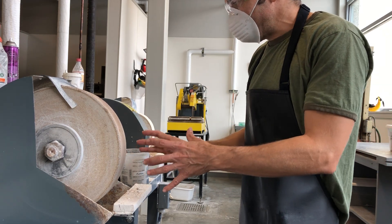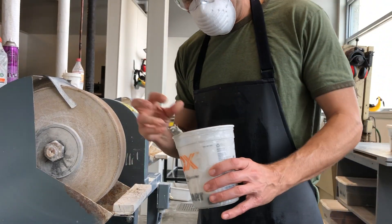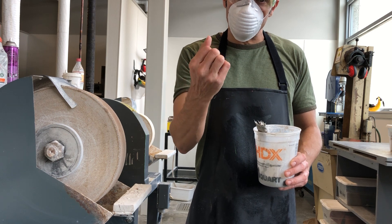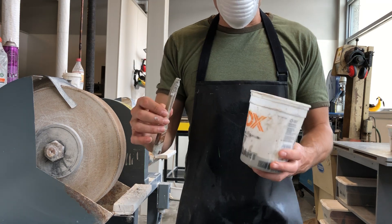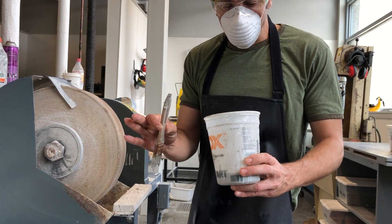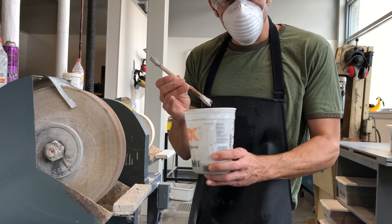This particular wheel here — the cork wheel — is for pumice. Pumice is a volcanic stone. It comes in a powdered form, different sizes. It's sort of a finer grit, but it's soft — it sort of pulverizes as you're working with it. If it's the right consistency, the finer the pumice, the more when you mix it with water, it becomes thixotropic, which means that it will liquefy under vibration.